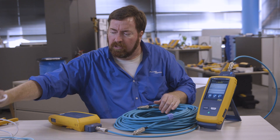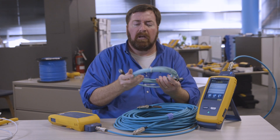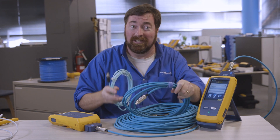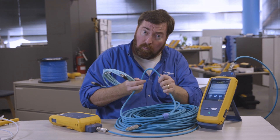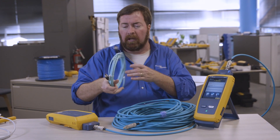What about the situation where I'm using an industrial environment and I'm going to be using something more heavy duty? Here I've got a 600-volt cable. It's not going to run 600 volts — it's designed to be next to 600 volts. It may have a special jacketing material that's more resistant to mechanical stress, even sunlight or toxic chemicals that may fall on it.